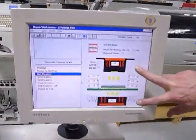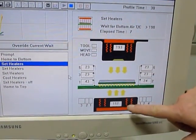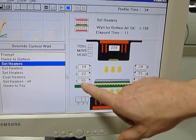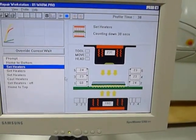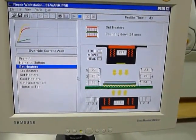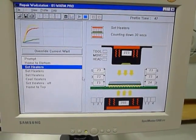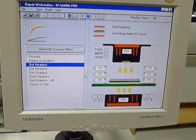These indicators are red showing that the heaters are on. You can see the temperatures coming up at the heaters themselves, and we also have a thermocouple in channel one on the board just to show you that the temperature on the board is coming up as well. Looks like they're pretty close to where we want them.